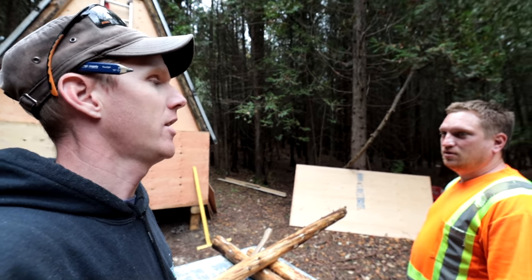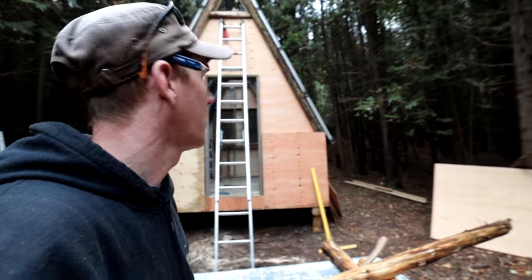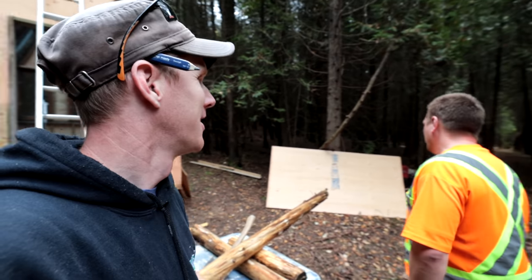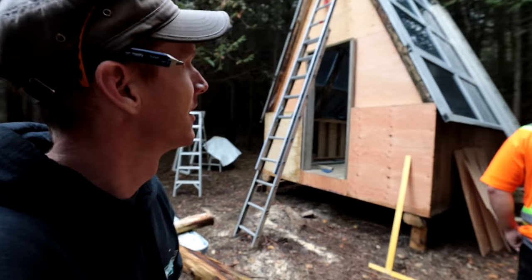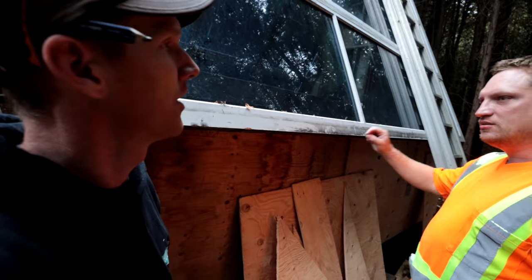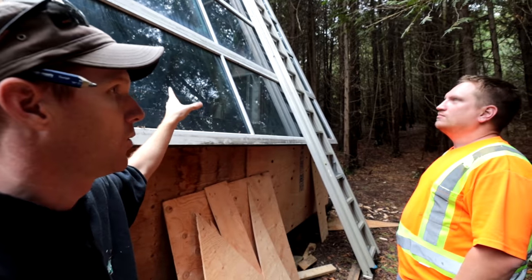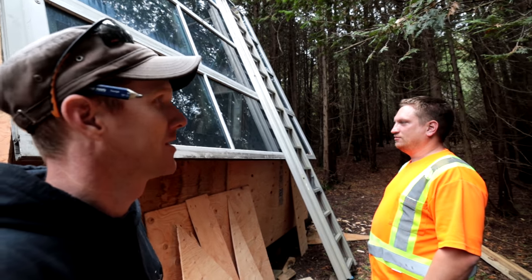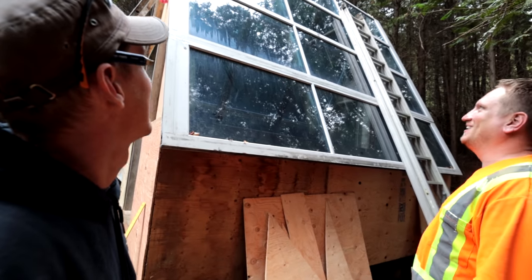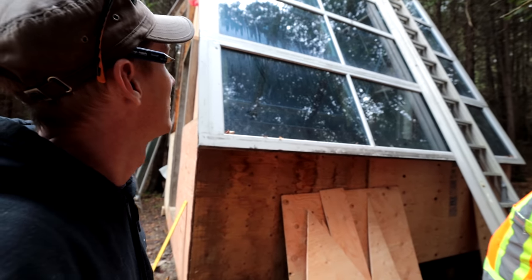We were discussing whether the frames themselves are waterproof. Dom confirms there's butyl tape around the frames, around the openings, and the glass is set into the opening. I was going to pro-glaze around each individual window just in case, but it sounds like I don't have to. Each seam also has weather stripping between panels as well as caulking. So this thing is going to be pretty solid — it'll withstand 100 kilometer-an-hour rains.